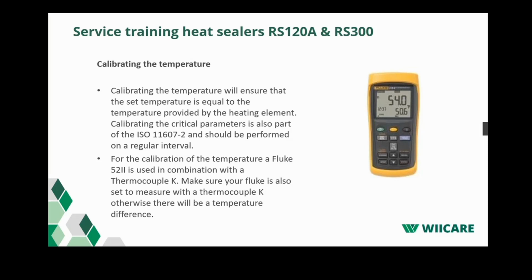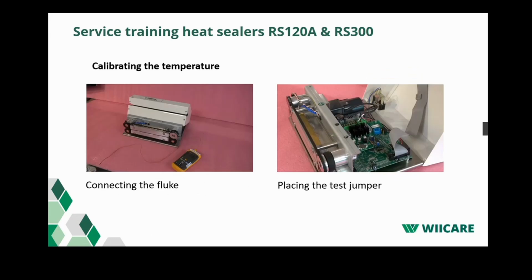For the calibration of the temperature, we use a Fluke device. There are many other brands in the market. We found that the Fluke device works very well. It's very consistent and gives a good reading. When you buy the Fluke device, you can buy a thermocouple with it, a thermocouple K. But always make sure that when you use that thermocouple, you set the Fluke also to thermocouple K. Otherwise, you could have wrong readings. In the next videos, it's explained how to perform the calibration of the temperature.